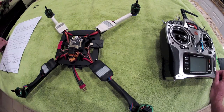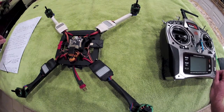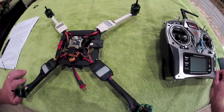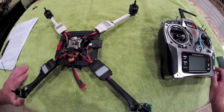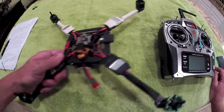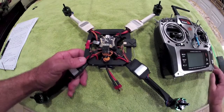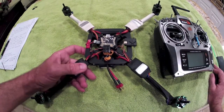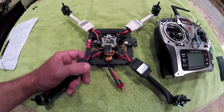This is just a quick walkthrough, a quick reference guide, so to speak. This is by no means an instruction manual or a substitute for the amount of research you should do online to make sure you fully understand the equipment you're working with — the hardware, software, and firmware. You want a firm understanding of this because if not, your setup may not be correct and it would not be safe. To start with, number one: have your props off.